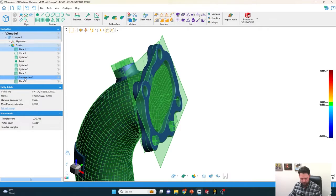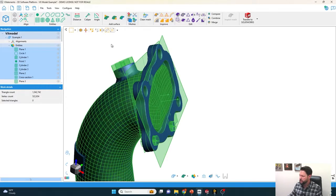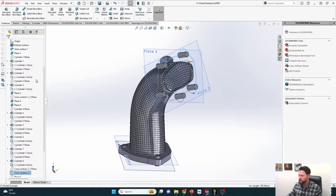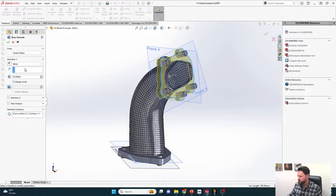Once we're done with the features, we right-click and select Transfer To. I've got SolidWorks installed, so I can transfer it there - we also have Inventor, Fusion 360, and Solid Edge as options. I'll bring up SolidWorks where I've already transferred the features. Here you can see we've got our cross sections, cylinders, and NURBS surfaces all dumped over to SolidWorks. If I look at any given cylinder, there's a plane and a sketch associated with it - all parametric features, which is really nice.